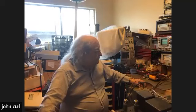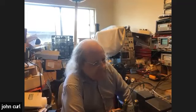Well, we copy each other. I mean, it really comes down to it. Back in the day, we started out with a very primitive kind of design. And that design has developed over a period of years. Back in the middle 60s, late 60s, very simple designs were made. They could be as low as, realistically, 8 transistors: 2 outputs, 2 drivers, 1 input and 1 second stage. The input and the second stage did all the voltage swinging and developing everything, and the output would just give you the current. And that was the original amplifier that everybody used.